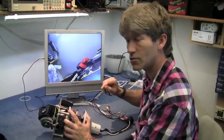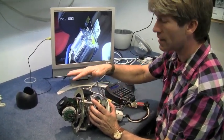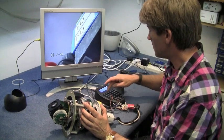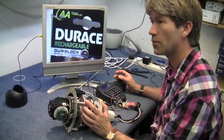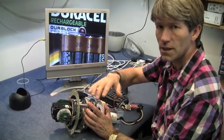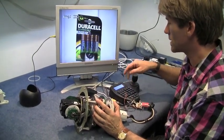Right, now I've got to go and find a controller. I've set up the controller to the camera. You have to use an ID so that sends a little bit of information to the camera to say you're the camera I want to operate. All the up, down, left, right works and zoom in and out. Now then, that's a packet of batteries four meters away — that's been loaded into the memory as to where that battery pack is. So if you had this in a security situation, you can have an area over there which is a doorway and another area which is windows — you just have all these different presets in.